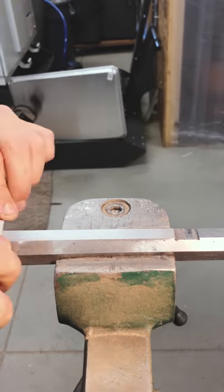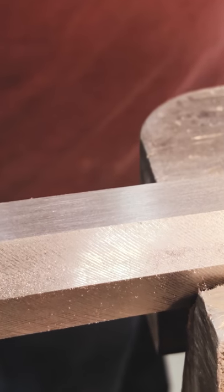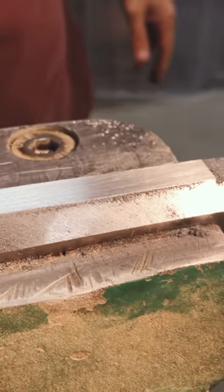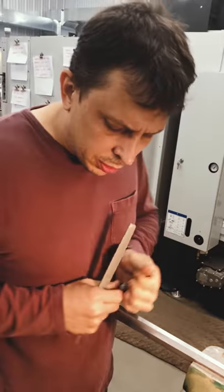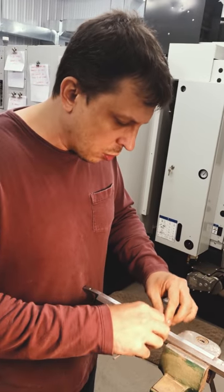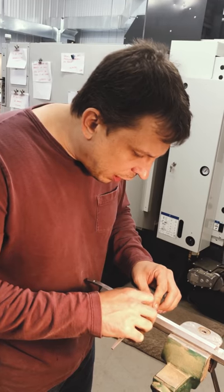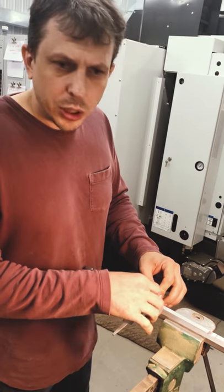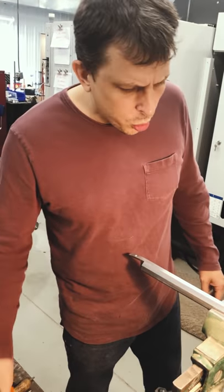Just as quick as that, the area between the breech and the sight has been draw filed and it's a very nice finish — it almost approaches a coarser ground finish. All those mill marks are gone, simple as that. A few tips: one of the challenges for a beginner is not rocking the file. You want the file to be flat on the surface you're trying to draw file. I read the surface as I'm filing, making minute adjustments until I find the flat sweet spot.